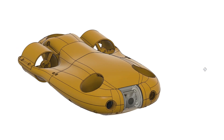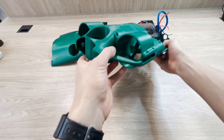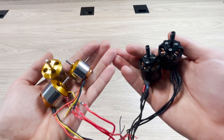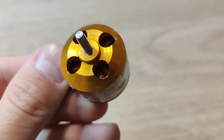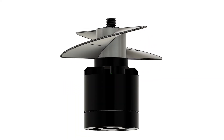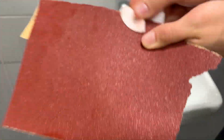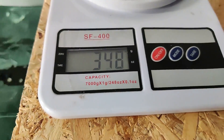Let's figure out the propulsion system. We picked up inexpensive low-speed drone motors for vertical propellers and beefier airplane motors for the main thrusters, which make the drone go forward and backward. These motors can work underwater just fine — corrosion might be a problem over time, but rinsing with fresh water after use in the sea should make them last a long time. We designed simple propellers for the horizontal thrusters and more interesting-looking propellers for the vertical thrusters. It's crucial to sand the propellers as smooth as possible — we verified with our homemade thrust meter that sanding gives over 2x more thrust compared to not sanding.